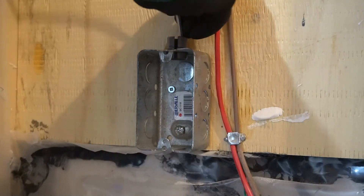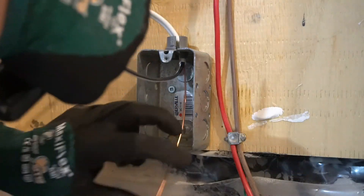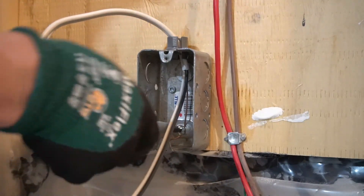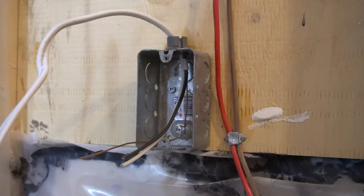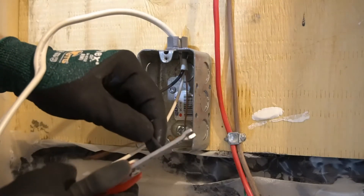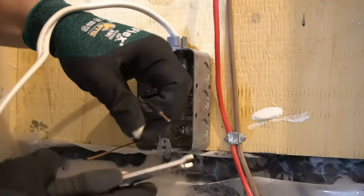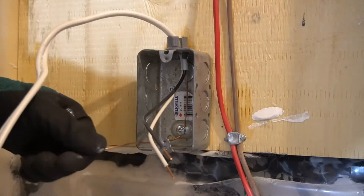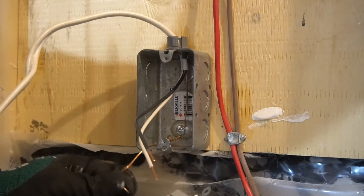You don't have to have these — you can just get a knife and make a circle cut around the wire, just be careful not to cut too deep or else you will damage the wire inside. Now I will slide the wire through at the top, slide all the way down, show a little bit of the jacket. Now I will bond the box — make sure the ground wire is wrapped around the screw clockwise. Now let's cut the wire about six inches long.